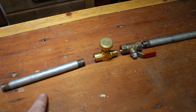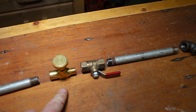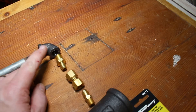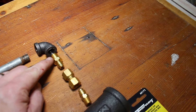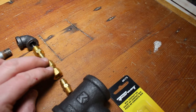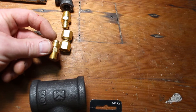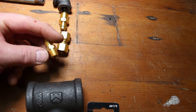This is a nipple — this one's six inches long — and then I have a needle valve. I'll put a link in the description for that. Then I have just an emergency shut-off valve, and another six-inch nipple. From here I'm going from a quarter-inch 90-degree pipe thread fitting, then to quarter-inch flare, then to a coupler. This piece is quarter-inch flare to eighth-inch pipe threads.